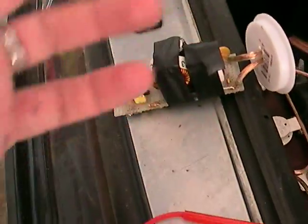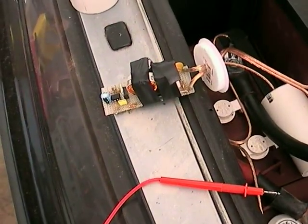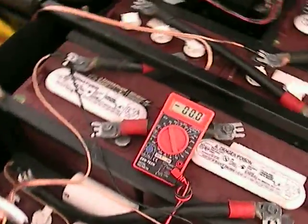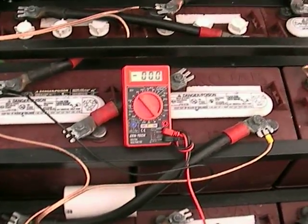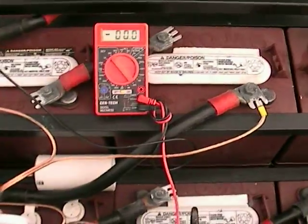It's using these coils to help build up this charge from 12 volts up to 46 volts, and the timing circuit will collapse the magnetic field and throw the voltage back into the batteries. It does this extremely fast — about every 50 milliseconds, which is quite quick.